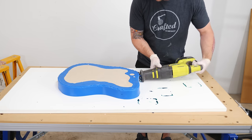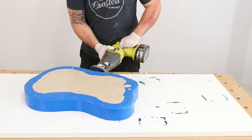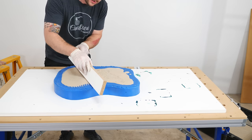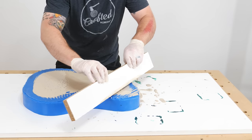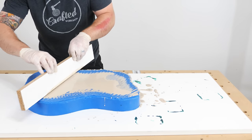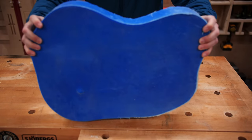After filling the mold I came back with a reciprocating saw with no blade installed and ran it along the outside edge of the mold to help vibrate out as many bubbles as I could. Finally I screeded the surface of the concrete with a straight piece of wood to remove any excess and level out the surface. After that I let the concrete cure for a few days, then had to fly back home and shipped the concrete guitar body — still in the mold — back home to Asheville.